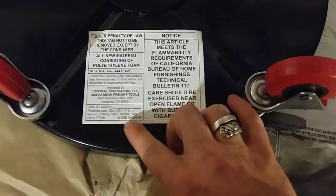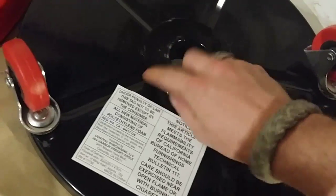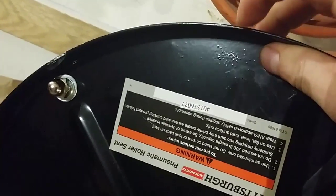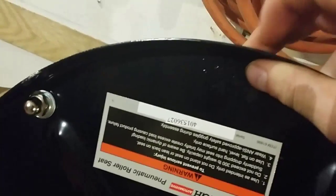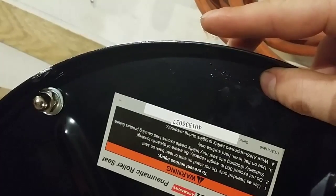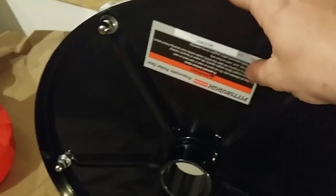Made in China. The base is pretty thick — it seems to be all made out of the same thickness of sheet metal. It looks like it's stamped by a machine: they put down a disc, a big piston comes down, and it gets punched out. Probably like an eighth to a sixteenth inch — I'm not really good with steel gauges. But stamped steel like this is pretty strong; I can't push it with my hand and make it flex.